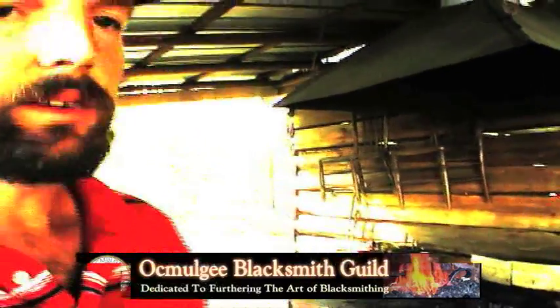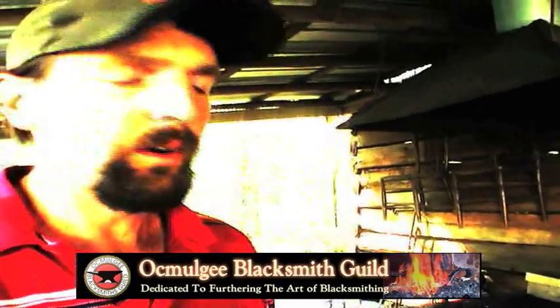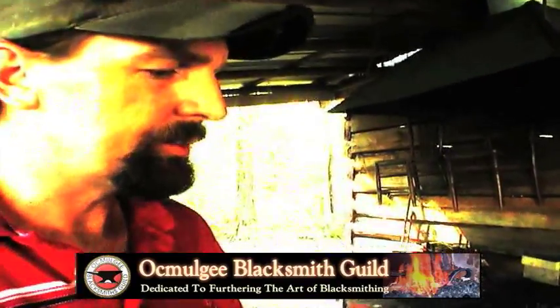While you're forging it, you kind of need to watch your temperature. You don't want it to go over an orange color because you'll get a little bit too much decarburization. It's a simple steel, 1084.